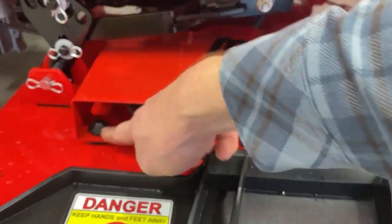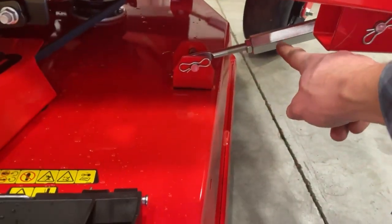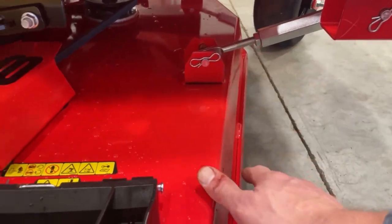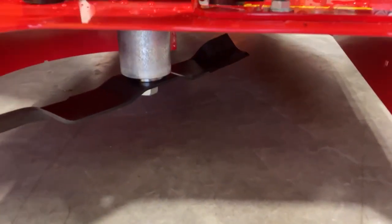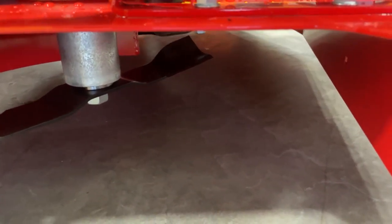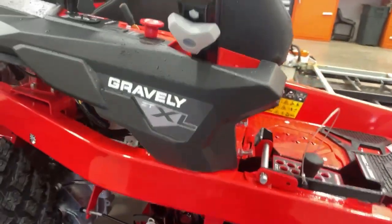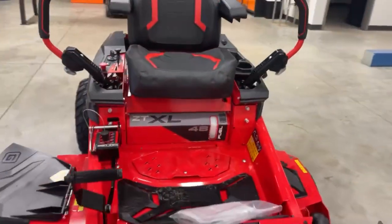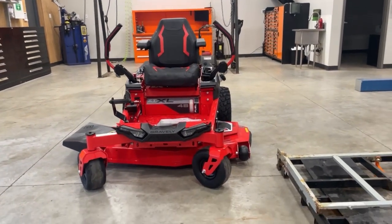The belt covers are mounted on rubber bushings, so if I have the deck down a little lower, I can actually quickly remove that. We've got easy adjustments on pitch. Looking underneath the mower deck, we've gone to a beautiful aluminum spindle — very similar to what's on the commercial machines, a forged aluminum spindle, but not quite as heavy duty as on our HDs and commercials. Still a good one. Redesign of the mower deck belt routing, which should lead to better belt life. Well done, Gravely engineers — we're excited to see what this thing will do in the field.